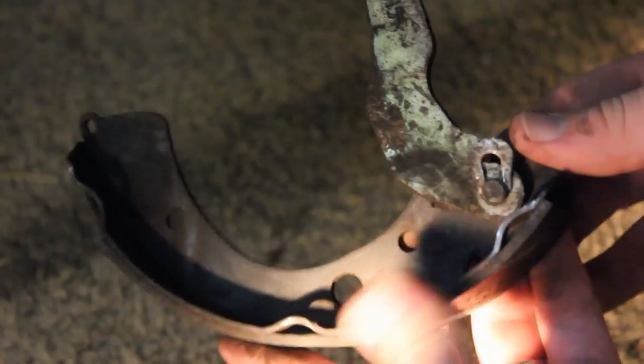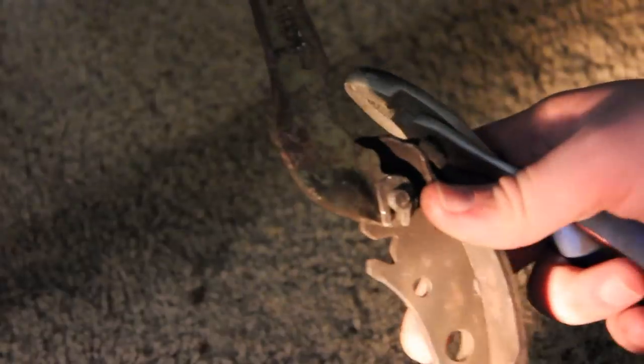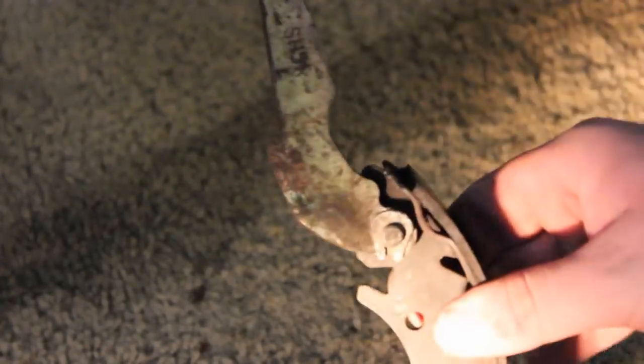So I like to kind of work the C-clip on like that, and then I like to take a little ratchet here and just bang it right in. Now that's in nice and secure. Then I'll take the side cutters and squeeze down to close them here. Actually, it works a little better if you take some pliers because you can get a better grip on them. You just want to squeeze them closed a little bit more — and just like that, it works just fine. The C-clip will definitely not come off.